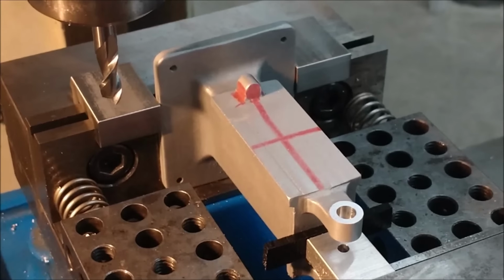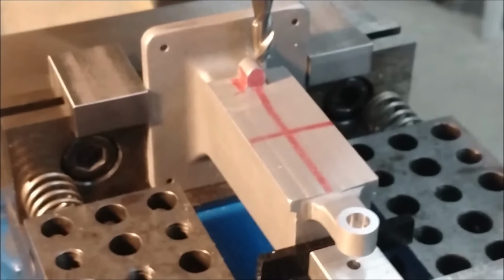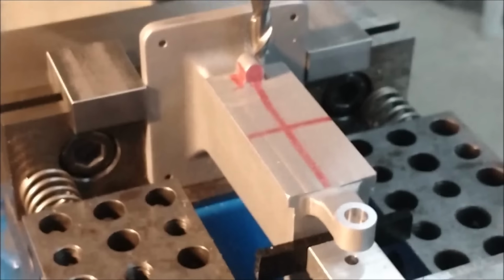Having made contact with each side of the lug, I can determine exactly how far off center I am, or determine whether or not I want to use this as the center. This does not have to be true to the spindle bore because the table moves back and forth. So this has no relationship to the spindle bore, none whatsoever. I will track the outside of the dovetail at this point to see if the shift is warranted or what. This is one of those moments where the exploration will pay off in the final end. So let's just take a minute here and figure it out.